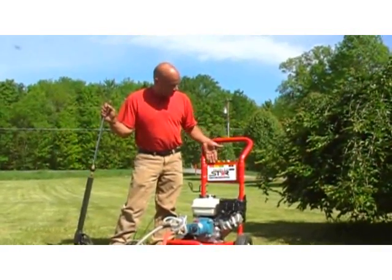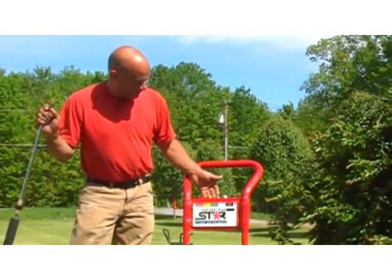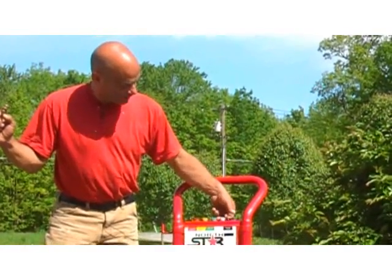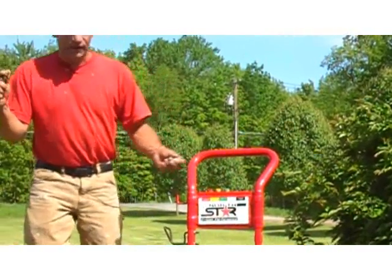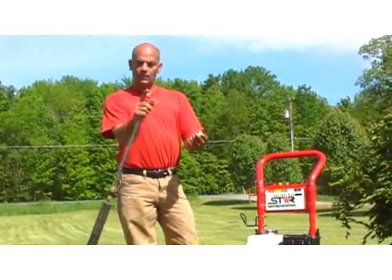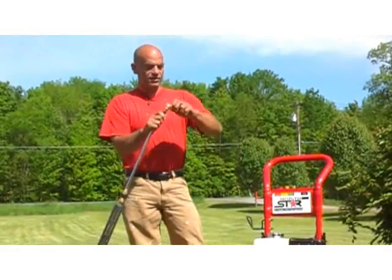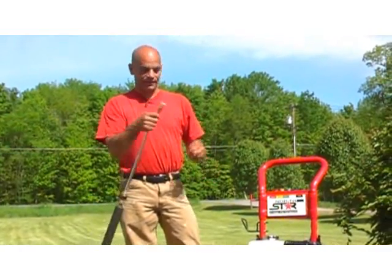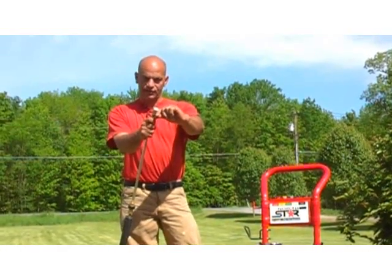All right, well, now it's time for me to pick my nozzle of many choices. Well, what we're going to be cleaning, the house, the vinyl siding actually. So I'm just going to take the 40-degree nozzle, and the house is dirty, but it's not concrete or anything like that. Again, with that quick connect with the coupling here, pull it back, put your nozzle in, just like that. And this is something you definitely want to make sure it's nice and secure, otherwise it'll go flying into your neighbor's house.